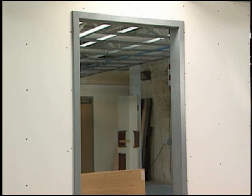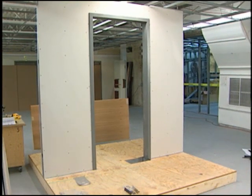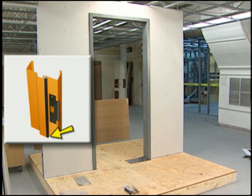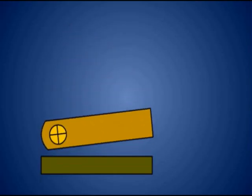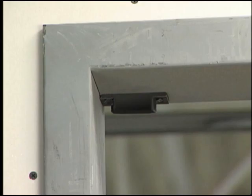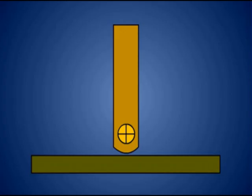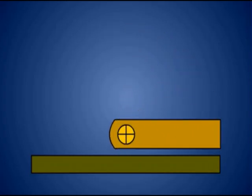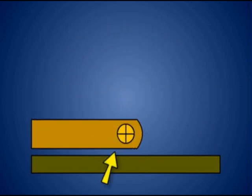A cased opening frame is used for center-hung doors. Unlike the offset product's rabbeted frame, this frame has no stop — when opening, the door edge moves away from the frame. This Rixson 28 closer is single-acting and requires an applied stop on the lock edge. Center-hung closers can also be double-acting. A center-hung door must have radiused edges.